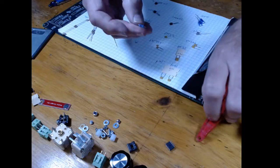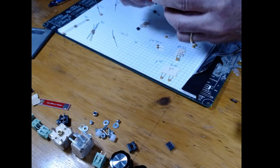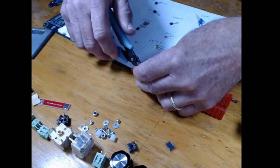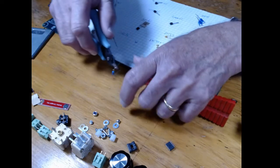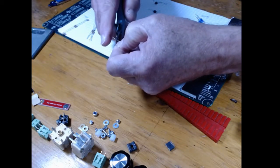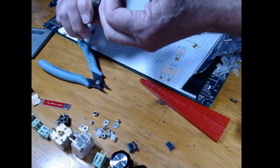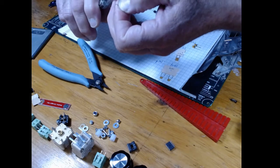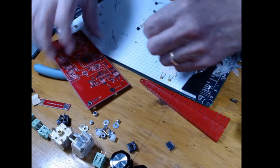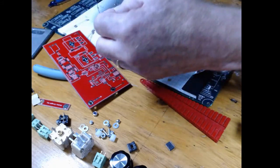I'll go down and make a nice 90-degree bend. One of the things I can do is, when I do that, I'll cut it with my pliers, and I'm going to be even with the bottom of this guy. I'm going to cut it right about there. And remember to put your finger over it so that lead doesn't go flying. I'll cut the next one at the same position. I'll take my little pliers and I'll go maybe half a pliers width and make another 90-degree bend out and make a little foot. Okay, so now when you set this thing on the board, you got these little feet that sit on the pad, and if they go out at 90 degrees, this one here didn't quite make 90 degrees.